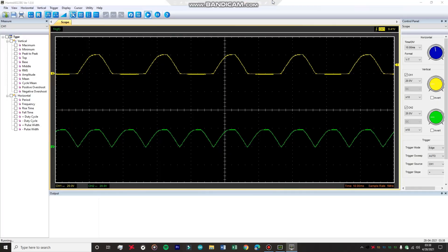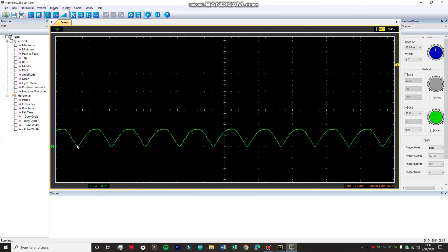Let's fire up the oscilloscope and the circuit. You can see we are obtaining a beautiful output - this is identical to the output we got from our center-tapped rectifier. These are the positive bumps we are getting. On the input channel you can see a different waveform because we have referenced the negative terminal of the output as reference. Let's just focus on channel number two - you can see these beautiful bumps. Now let's add a capacitor to the mix.